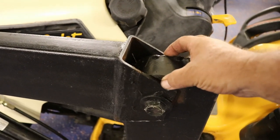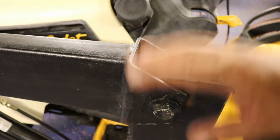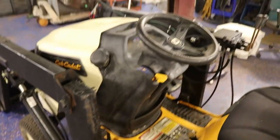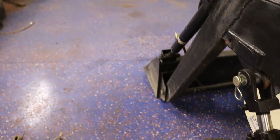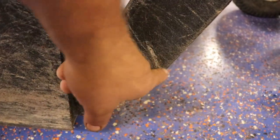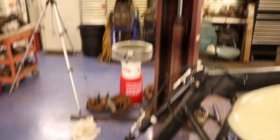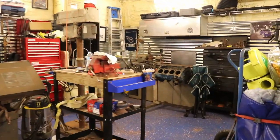This is all that bigger square tubing I was talking about — I cut the top off with a hole drilled in. I capped everything and put a piece of pipe through it, drilled a hole, put a piece of pipe in, and ran the bolt through that piece of pipe. Because this is thin-wall stuff and I want it to be light, I did that on that particular spot and also down here on the bucket — put a piece of pipe through the tube and welded it in so you don't have the problem of it squeezing together.